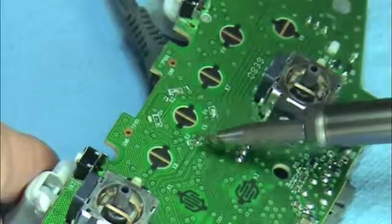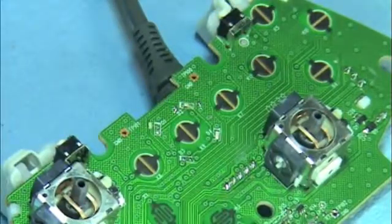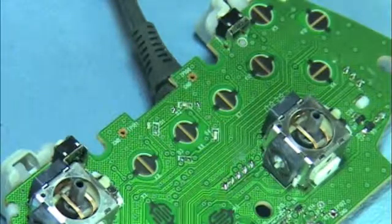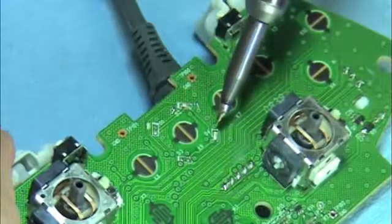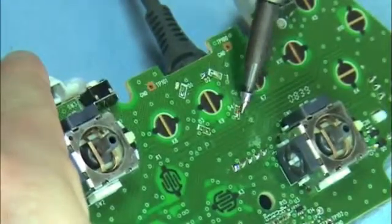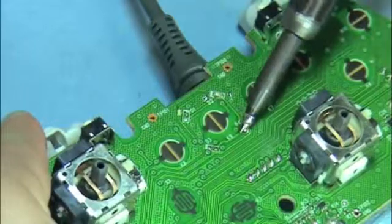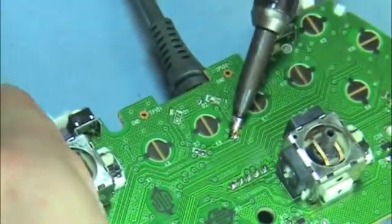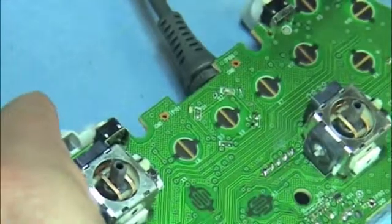It's so much easier when you can move the circuit board — the picture still looks good. Do not — I repeat, do not — grab onto the LED with tweezers because you will snap it and then you're in trouble. We're going to try to get number four off now. When they come off, they come off real quick, so be careful not to burn the board.